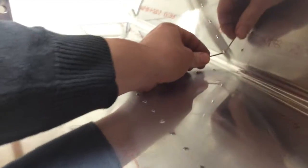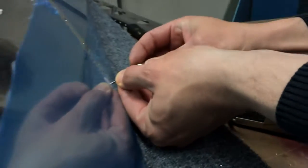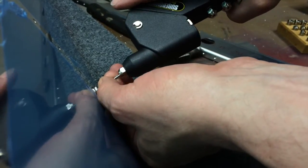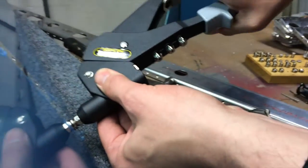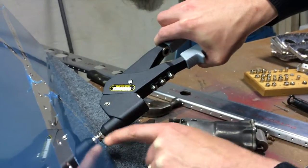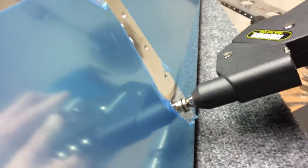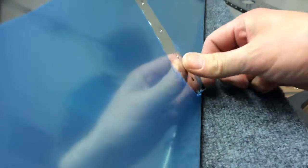Put it through the back side of your work — that area where you just can't get the C-frame in and can't get the squeezer yoke in. Put the male on the outside, keep it as tight as you can while you put the puller on there, and then you can give a little more pressure. You'll see right around the outside edge of the die it goes back to being flat when you're almost done. It doesn't give quite as good of a dimple as the standard dimple dies, but it's certainly acceptable for those tight places.